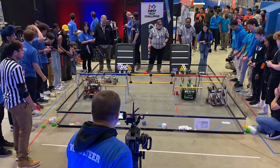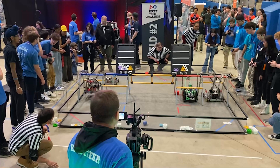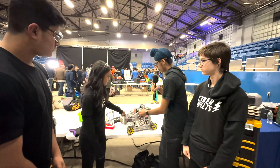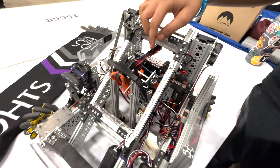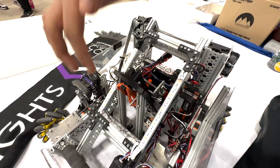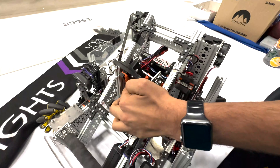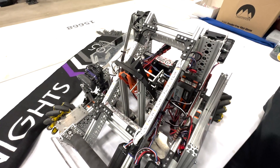Moving on to your drone — how does that work for your robot? Those are a big part of this year's end game and really important for getting those TBP2 points. We have a 3D printed drone launcher powered by two rubber bands that you see here. It goes all the way back and latches on through a hook. In a match, the servo will unlatch the hook and the rubber bands push forward, causing our drone to launch.